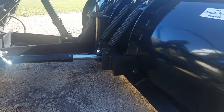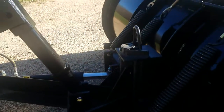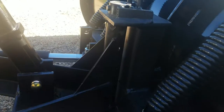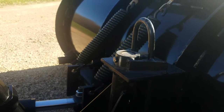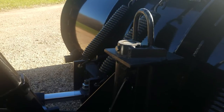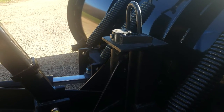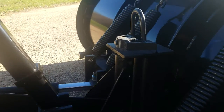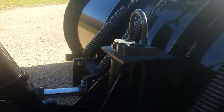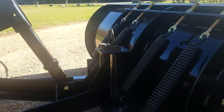One of the main things to keep in mind — we use a big inch-and-a-quarter main pin here. This pin is greasable, and it gives you a very rigid, durable plow. You could run this thing into a tree — I don't suggest it and we won't warranty it — but it's strong enough you could. That inch-and-a-quarter main pin has no give to it, which makes for a very durable plow.